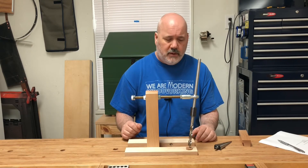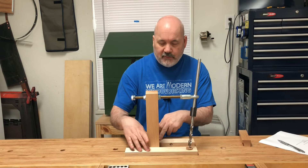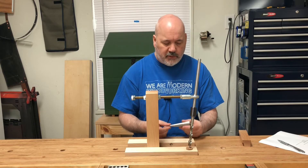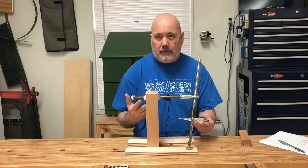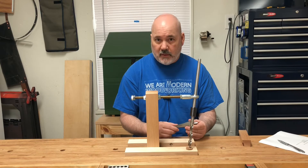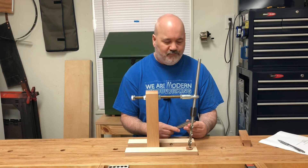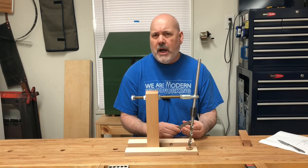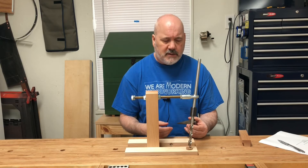You can also ream with this jig. You can set it in place for a leg mortise, drill the leg mortise, then — while the jig is still clamped in place — switch out to your reamer and ream the mortise. This reamer is Lee Valley's reamer, which I think is at a 12-degree included angle. A majority of chair makers I know use a six-degree reamer, which is what I use. I'm in the process of finding someone to manufacture a six-degree reamer, so stay tuned. If you use the 12-degree reamer, there's also a maker — Sean Murphy — who I believe sells an 11-degree reamer. All of those can be utilized within this jig.